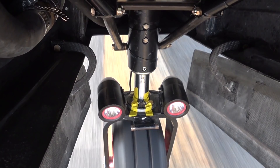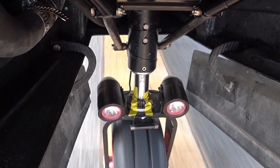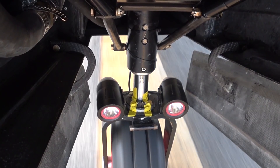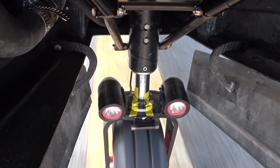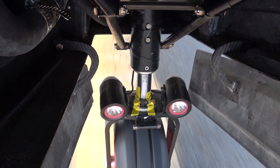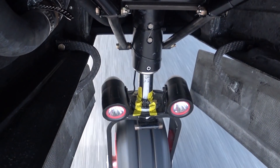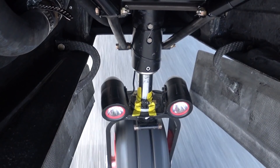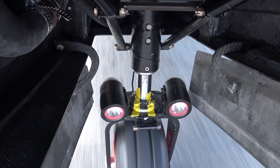You can see there it almost got going but then stopped, and through the next few frames it's nice and steady again before it kicks in. You'll see it hits a bump and that's what triggers it. Whether it's the strut hitting the centering mechanism that causes the trigger I'm not sure yet, but I think taking some pressure out and preventing it from hitting the centering mechanism may be the solution.